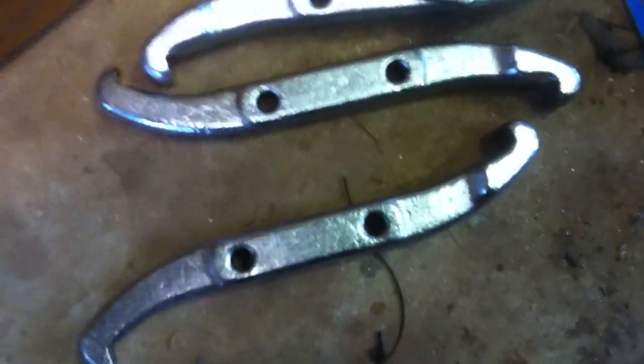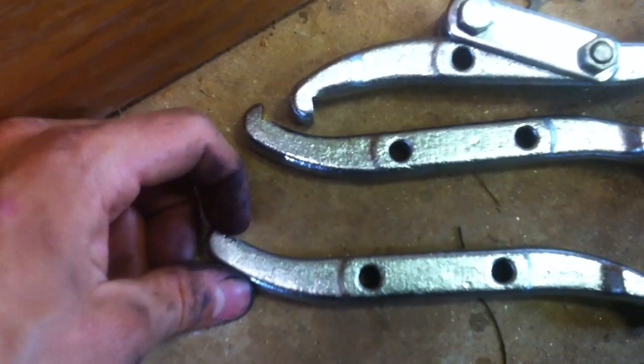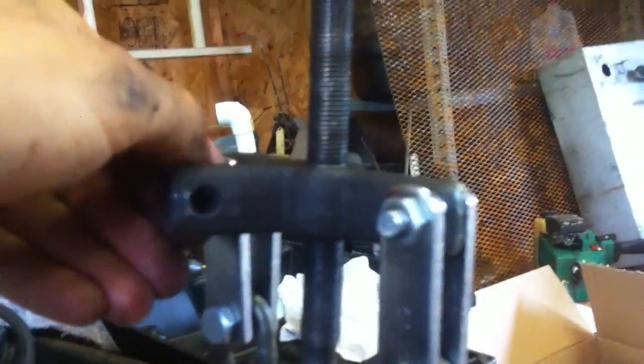That's why I went with the chain method. You can buy an extra long gear puller, but it's going to be a pain to get that down in there. If it pulls out and you have to put a lot of pressure on it, you'll probably damage the bearing carrier. Now, some of these lower units have holes drilled and tapped in them, and you can put threaded rod through a harmonic balancer puller — that'll work for the smaller motors.